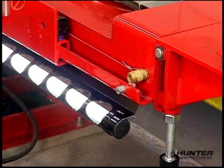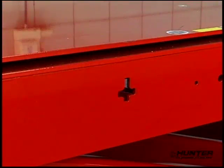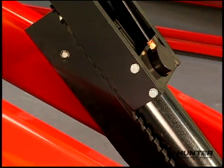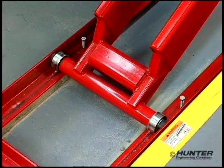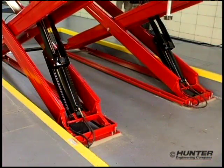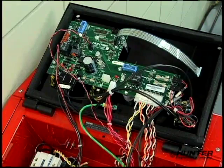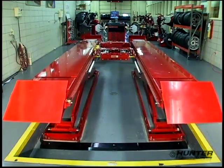Detailed and designed for extreme service, the RX Series lift racks are built well beyond standard specifications. You can see the difference in the details: runway construction is made up of ¼ inch steel throughout, extra heavy duty lifting legs, hydraulic cylinders, machined level locks, and hard chromed pivot pins operating in Teflon coated bearings — all guarantee smooth long-term operation. This lifting assembly is more than capable of handling rated capacity all day long, every day. Reinforced traction louvered approach ramps provide the grip you need even for slippery weather conditions. Hydraulic power is supplied by a 3 horsepower pump unit and monitored with a patented low voltage feedback system. The feedback system keeps the runways level and safely stops the system if an obstruction is encountered. Every RX is built to perform in the toughest of environments with a minimum of maintenance.